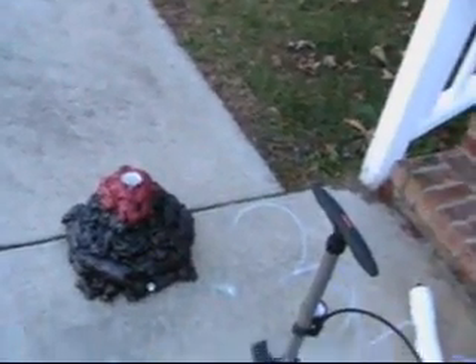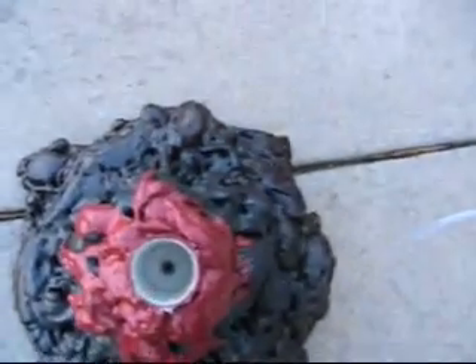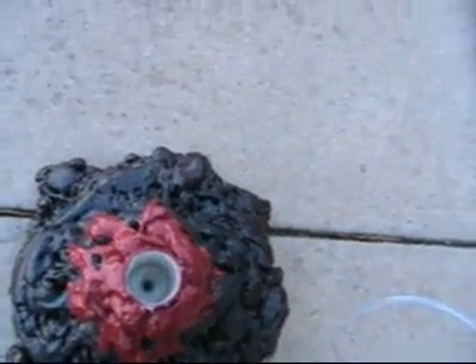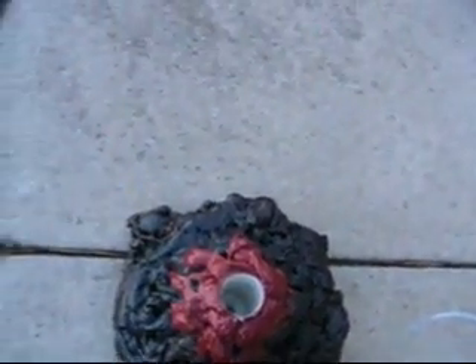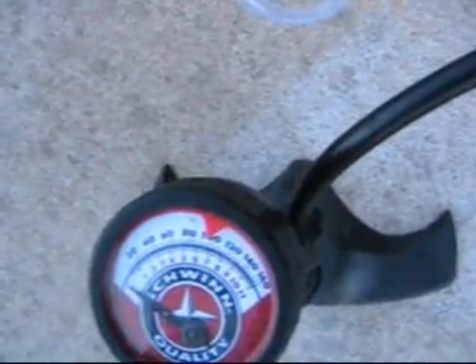We've got a very windy and cold day we're trying to do this on. This is going to be our first experiment of the finished product. Here's Joshua, he's going to be doing everything. As you can see, we painted it. There's the launching tube with the two inch PVC inside. We actually got a soup can holding this in place. Here's our quick connect that we're going to put the three-eighths inch airline on. We've got a bicycle pump with a gauge. Joshua's going to pump this up to around a hundred pounds. Our compression chamber with a valve stem we've inserted, and our release valve.